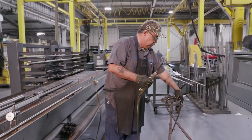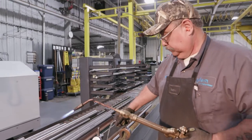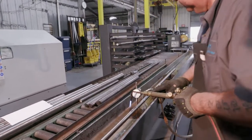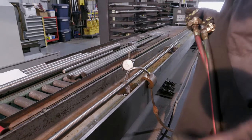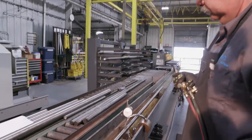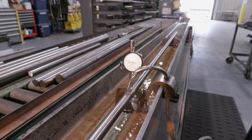What he's doing now is setting his torch — we're going to use heat to persuade that bend out of the shaft. Located on the top, he heats it and then quenches. The purpose of the heat and the quench is to try to get that runout to come past its top center.